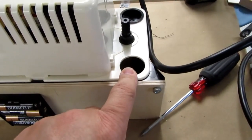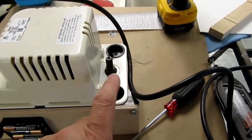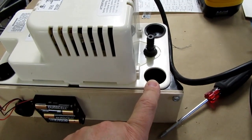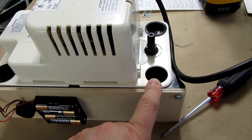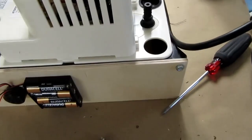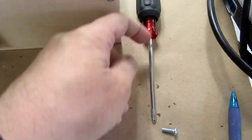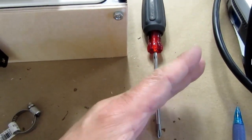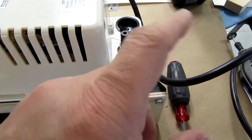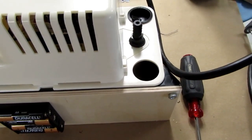So I needed to go to the hardware store and buy an appropriate short piece of hose that would go from the dehumidifier down only a foot or two and into this. And what I chose to do is just get a washing machine hose, which is typically fairly short in the first place and has a female garden hose fitting on each end. So I just need to cut that off at the proper length. And they caution that when you do that, you don't just cut the hose straight. You want to cut it at an angle. So imagine this is the garden hose here. You want to cut it at something maybe like a 45 degree angle. So when it sets down on the bottom, it can't possibly push down in such a way that it restricts the flow of condensate water from the dehumidifier into here, that with that uneven bottom, it's not going to lay in such a way that it can possibly plug the discharge.